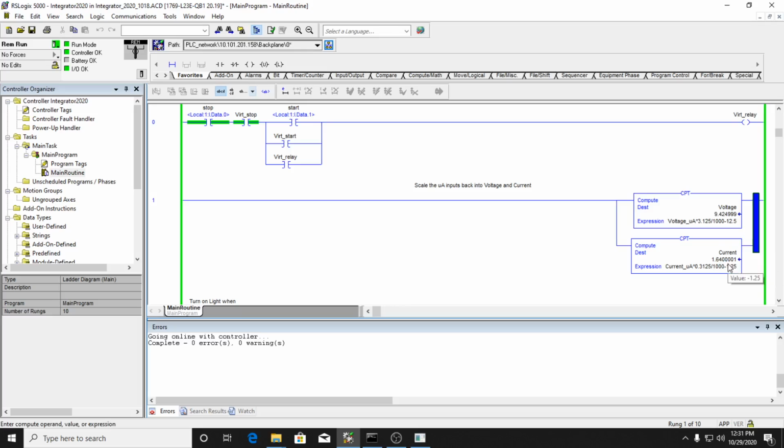So what I'm going to do is rescale it. As I said, the problem is the shunt that I have connected there is a little bit shorter than my calculation. My calculation for the shunt was 1.5 inches, but I cut it to be more about 1 inch, which is why it's a little bit off. But it's better to have your shunt a little bit lower resistance, so that you know you're not going to burn out your meter. And we can just rescale this now.